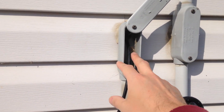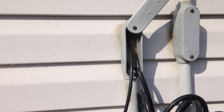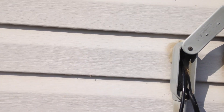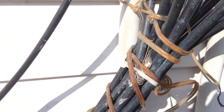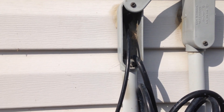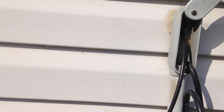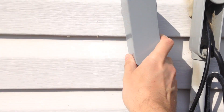There kind of is a spot right here — I've opened it up and there's one wire through there right now, which is a data wire for an old camera I had installed. However, this coax cable here will be going through there, and there won't be enough room to install three or four other cameras. So I don't want to tear that one out — I'm just going to leave it there and let it serve as the cable wire, then add a new box right here.